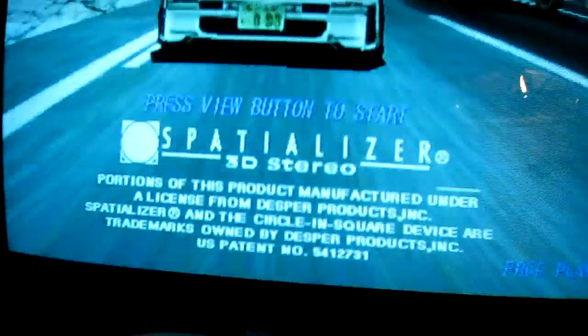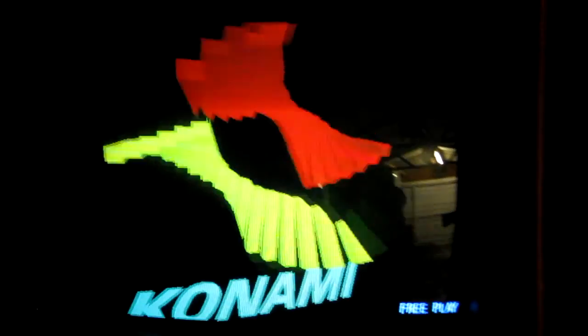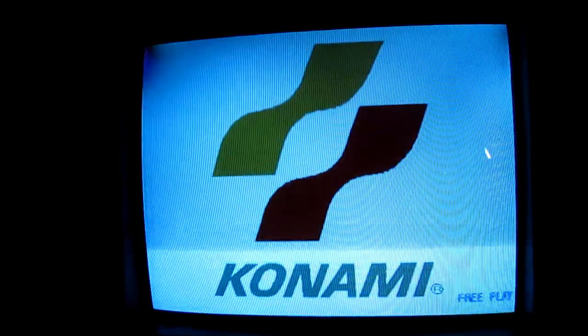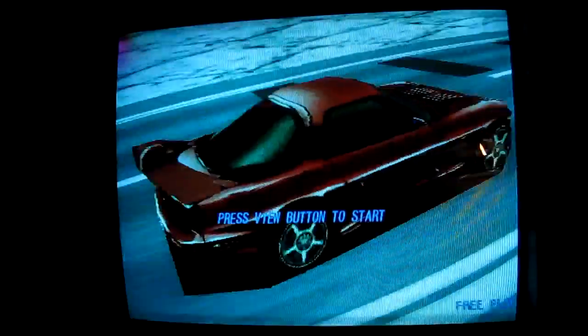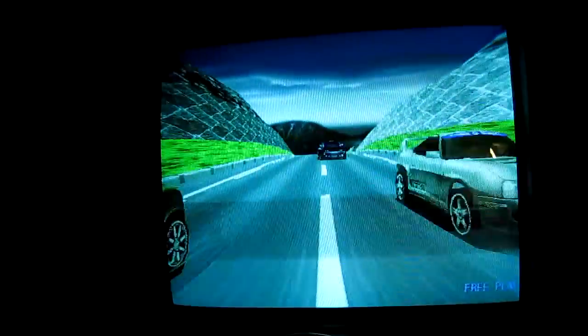And the jumping and flashing on the text is gone as well. Zoom out a bit. Yeah, there's still a slight shift when it goes to the white screen, but it's definitely a lot better. Little corner there needs degaussing manually, as it seems like there's permanent magnetisation in that corner. Okay, that's looking pretty good.